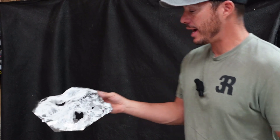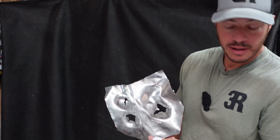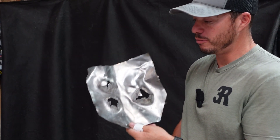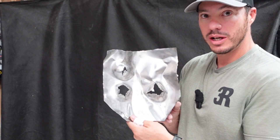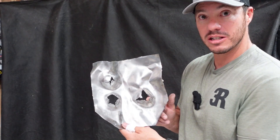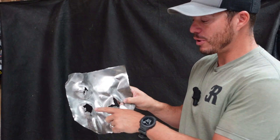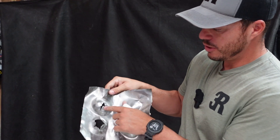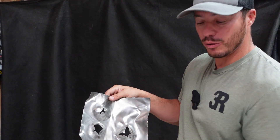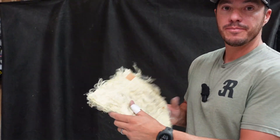After pressing and conforming to the shape of the plate, behind the fiberglass we also had one more sheet of metal. One of the big things you'll notice here is that the most common failure method for metal is to plug out — none of these plugged out. That is huge. That tells me none of the projectiles even made it this far; it was just the sheer strength and elasticity that broke it. There is no plug-out, no projectile that went through.